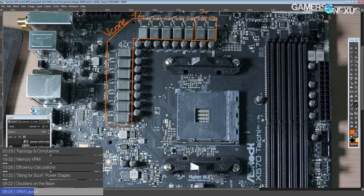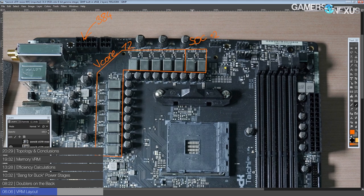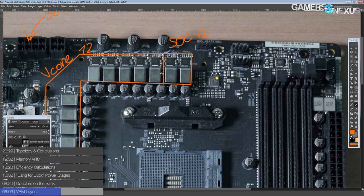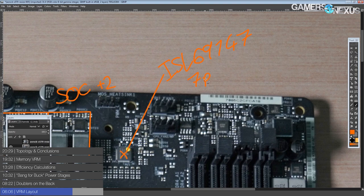It just doesn't make sense to put an APU in a board like this and use the iGPU to render games. If you're not actually using the iGPU, the SOC VRM is kind of irrelevant. The SOC VRM really only matters if you're going to be really pushing an iGPU — you could benefit from a higher phase count SOC VRM. But this board's really not meant for that. The control scheme for the whole VRM is an ISL69147, which is a new chip — I've not seen it used on any other motherboards yet. It's a seven-phase voltage controller from Intersil, and it's AMD-specific.